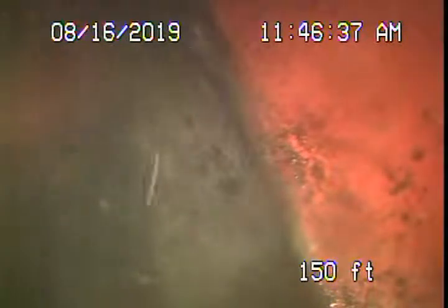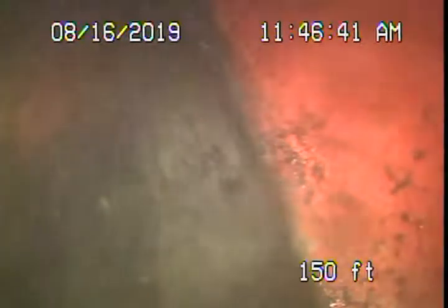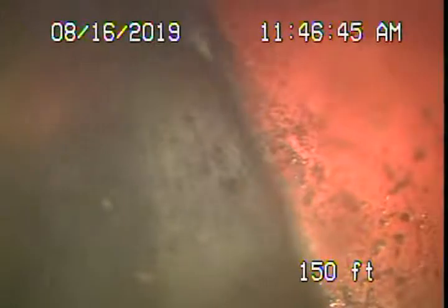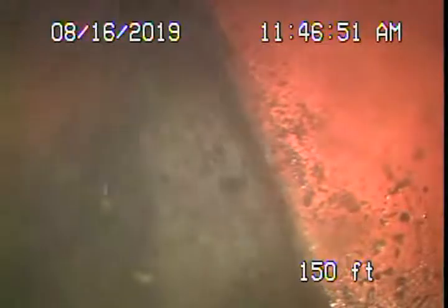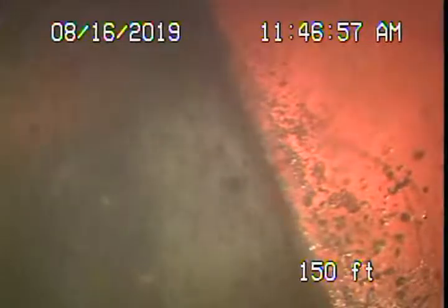We're here at 804 West Mount Drive in West Hollywood. We're running our camera from a clean-out located all the way in the back in the guest house, in the water heater room — it's an end-of-the-line clean-out. We run our camera all the way out to the city connection in the middle of the street, about 150 feet away. That's the city sewer out there in the street.